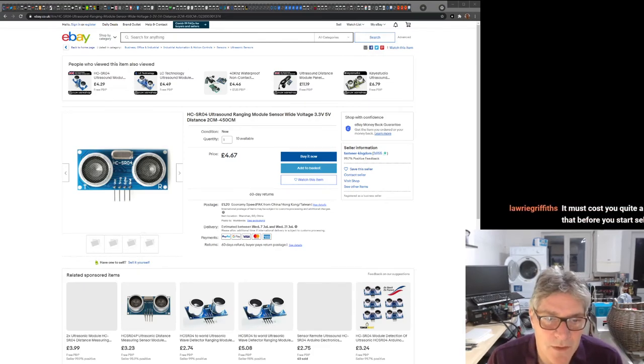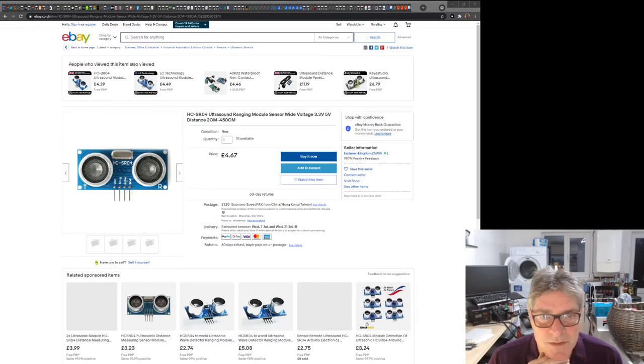In terms of the IMU connection, I'm thinking that should be connected to I2C and should be programmed from the microcontroller rather than the FPGA, because programming that stuff is actually quite painful, and that's a good thing to use libraries for. In fact, on the SuperTile, I could actually connect it to the ESP32 if we wanted. Because you have to do things like calibrate it and all sorts of stuff, I seem to remember. It's a long time since I played with one.